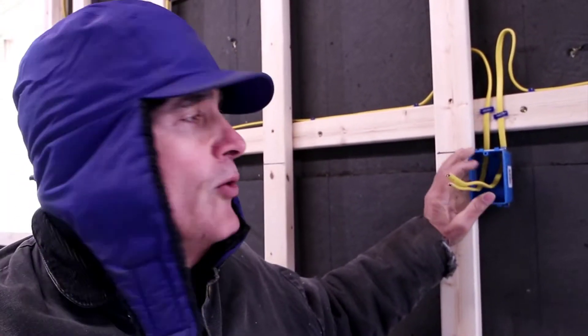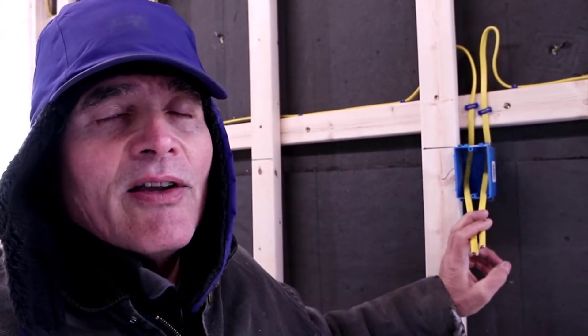Hey folks, Kevin here. It's March 20th, 2019. I'm over in the northern lower workshop area, and this is a continuation of the wiring of the workshop as we progress through the whole process of renovating and getting a workshop up and running. In the last video I talked about installing these outlet boxes or receptacle boxes four feet off of the floor, and I ran the Romex wire — 12-2 wire, which is two conductor and one bare ground wire underneath the sheathing. One of the things I'm going to do is start wiring and installing the outlets in these boxes.